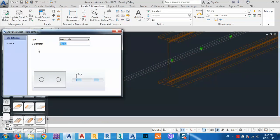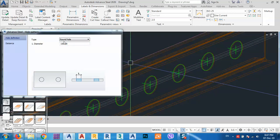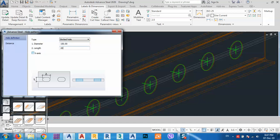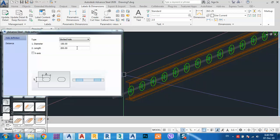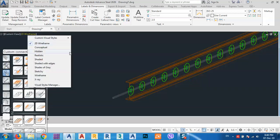The hole — we want 150. We can use round or we can use slot, slot by Y axis. We give it the diameter, say 150, maybe 200. This controls the shape of the castellated beam. About the distance — we have this. So we changed the shape, and after that we can change back to conceptual.